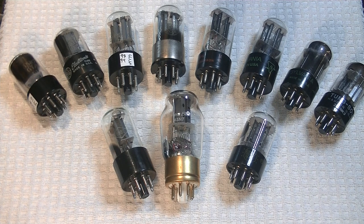What does hybrid mean? Basically, the Freya has two different but interconnected circuit topologies — in this case, tubes and solid state. It also has two different but interconnected tube circuits. The pair of tubes on the right-hand side are your left and right gain stage, and the pair of tubes on the left-hand side are your buffer, or more properly called a cathode follower.